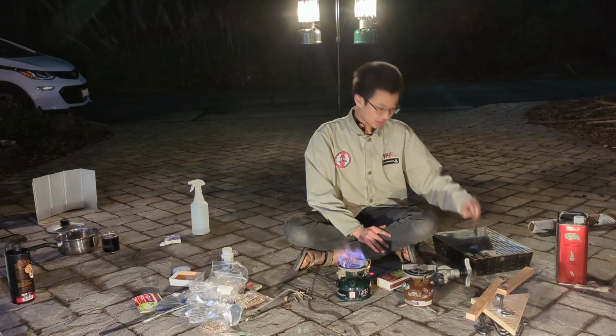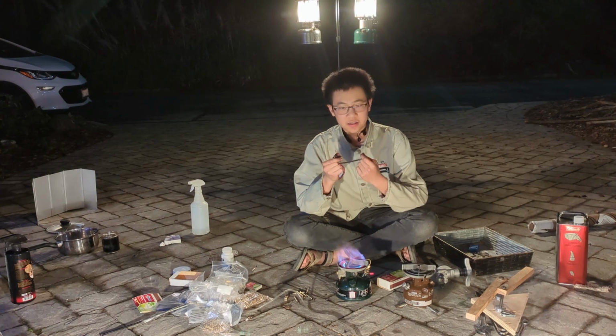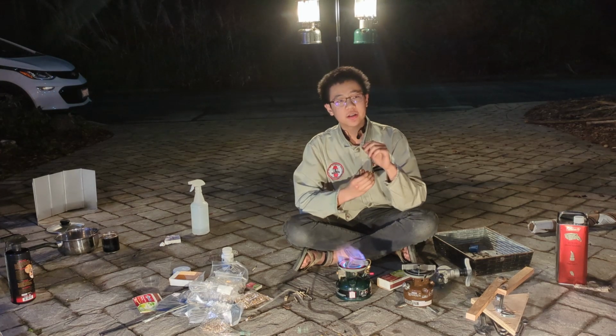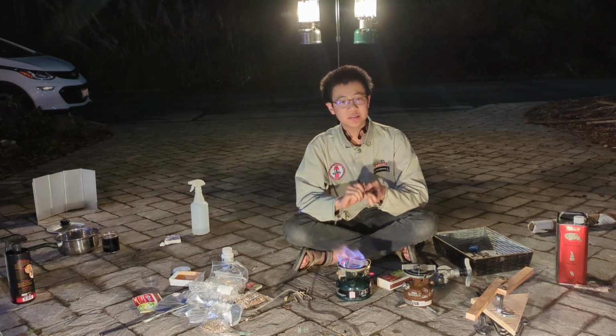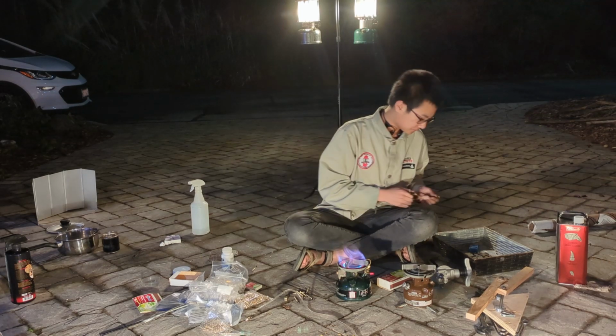Compare this to my flares. My flares, if you look at them, are shiny on the flare face. And there is no swage. This means that there's both a larger sealing surface and the sealing surface is smoother, leading to a better flare that will last longer and will not crack as easily compared to Coleman's flares.